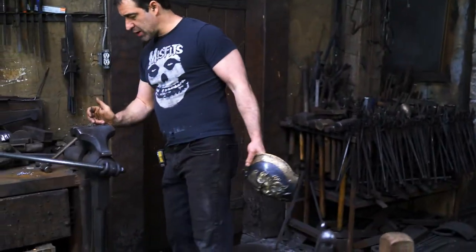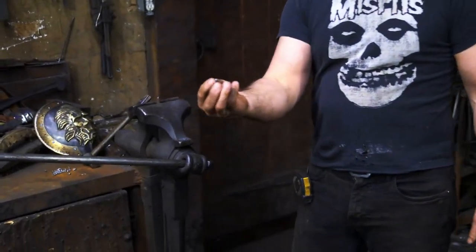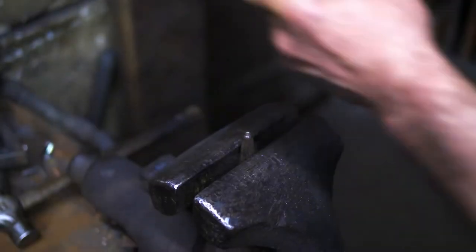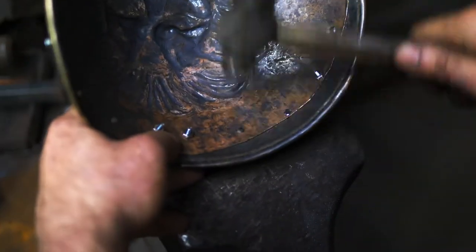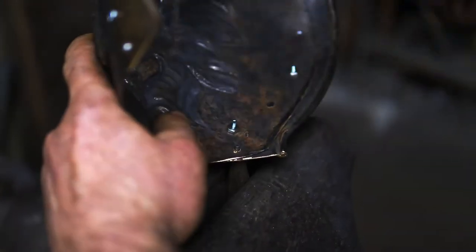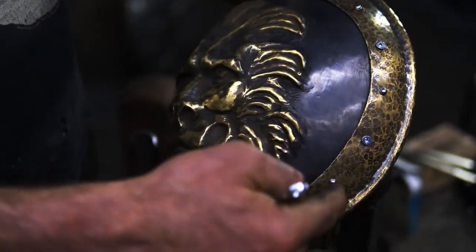I'll be over here. I've got a bird's eye punch, which I'm using for my rivet set to hold these rivets. I've got little eighth-inch rivets with a dome head on them. I've got the rivets in. When I had bolted this on, I bolted basically every other just to hold everything in place so I could put the rivets in.